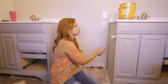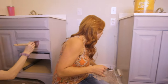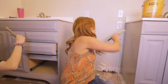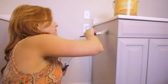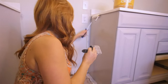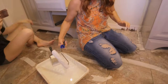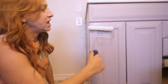Now that we've got two coats of paint on everything, we're going to go ahead and start applying the clear. The fastest way to apply the clear is with a roller. You don't want a really fluffy roller because we're not trying to create texture with the clear. I just get as much as I can with this, and then we can cut in with a brush — it makes it go super fast. Then I'm just going to roll out the brush marks one more time with the roller. The good thing about using a flat clear is it basically shows no imperfections. The fastest way to paint even doors is with a roller initially, just to get most of it on — these little skinny rollers get into all the crevices.